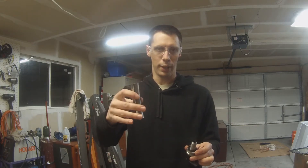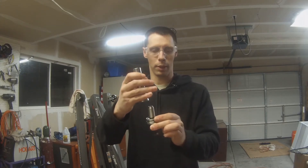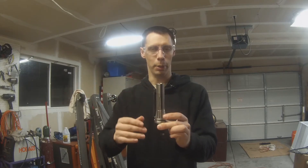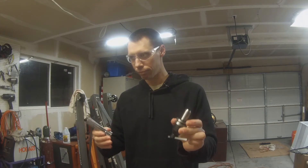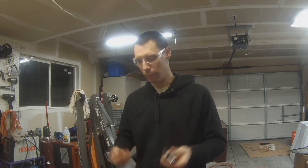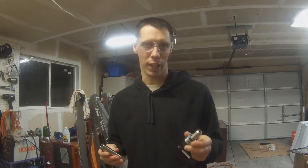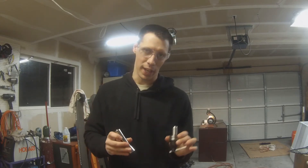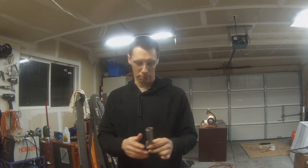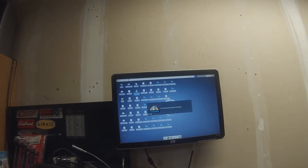With the TTS system, this can move up and down as needed and squeeze onto the shaft, but it registers against the top of the spindle — so it's repeatable. Got to say, it's the first name-brand thing I bought for this whole venture and I'm super happy with it. I've finally got enough of these holders because I kept ordering them and forgetting about one tool I needed, which made the whole tool table idea worthless. I think I finally have enough to just run it and use my tool table. I need to turn on the CNC controller — I'm over here trying to move the machine.